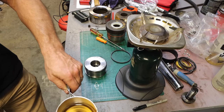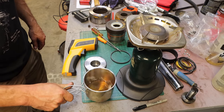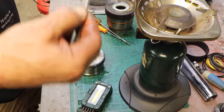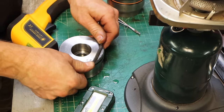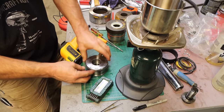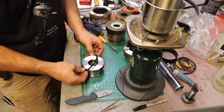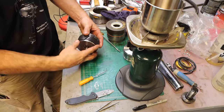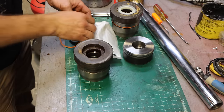We're going to be heating that up. A little hydraulic oil. Amazing what a difference that makes. I'm going to go ahead and do the other piston. One wear band. Right back on there. Second wear band. Let's knock out the second gland.